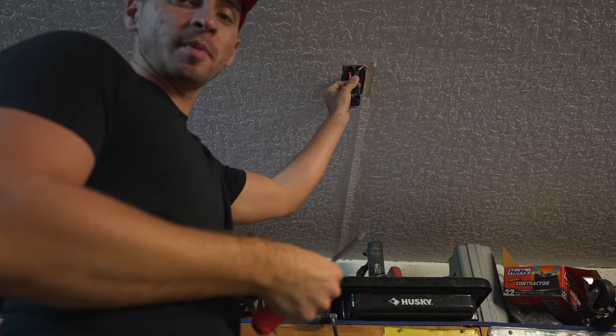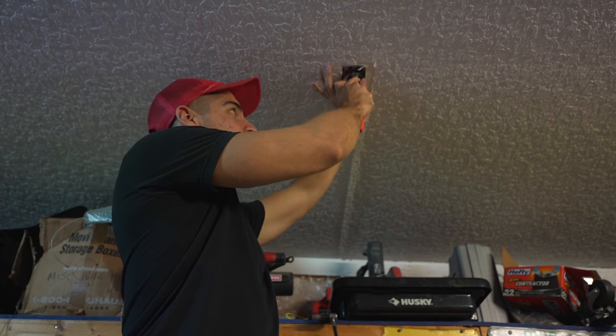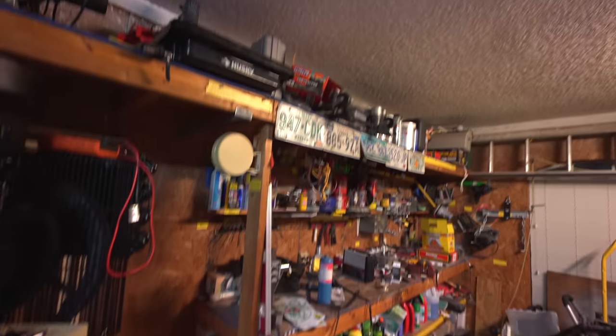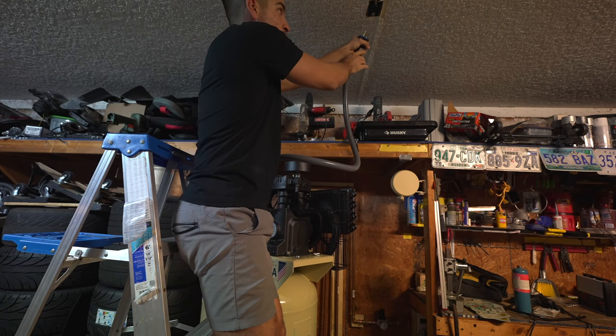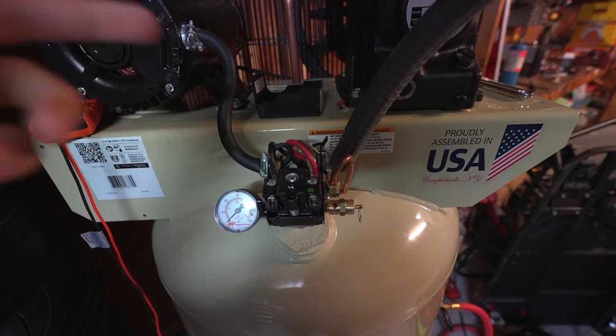I have each leg attached to each terminal. Now we just need to bend the wires, tuck this all up in there, and put the outlet on. I should preface — I said it's easy to add 240V to a garage, but I'm no licensed electrician, so don't take what I say as gospel. I have everything wired up, I just put oil in the compressor. We should be good to go ahead and plug this into the outlet. I flipped the breaker and will test for voltage on the pressure switch. Across both hots I have 240 volts — ground's on. Now is the moment of truth.